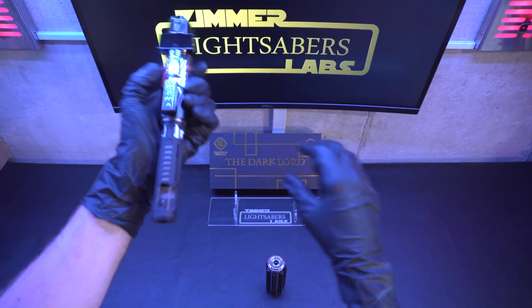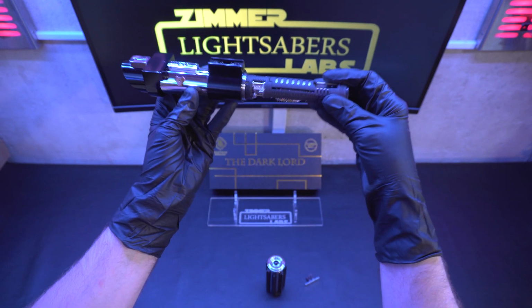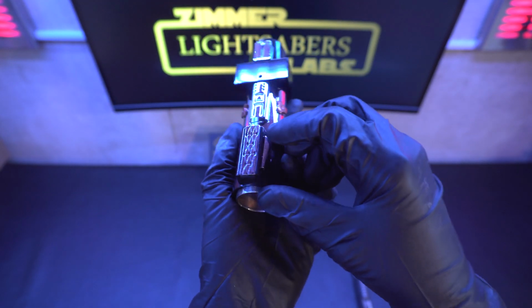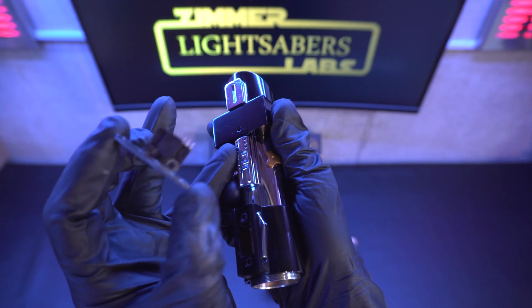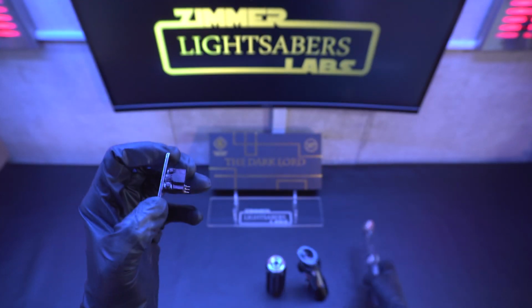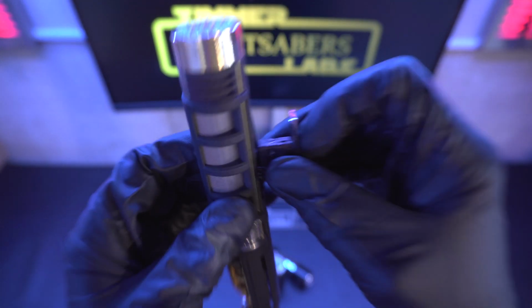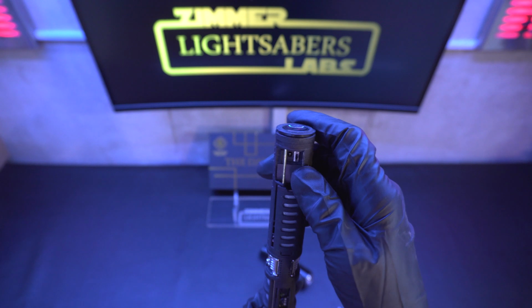Let's start by how it works. Unscrew and remove the pommel. That exposes the chassis. This is where it stops usually, but I went the extra step to make the chassis removable. That is accomplished simply by removing the switch assembly. The switch assembly, obviously, I customized a bit and turned it into a key of sorts. The whole assembly slides out. There's a pin connector in there. The switches are in there. And it slides back in. These guys mate with the female end of the header pins, which are right here. So this is what's happening when it's actually installed in the hilt. But this keeps it locked in place. Down at the bottom you have your recharge port and main power switch.